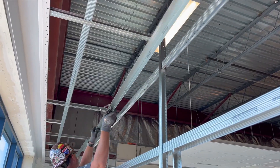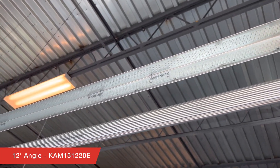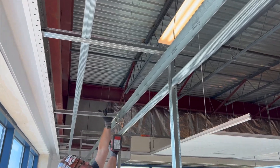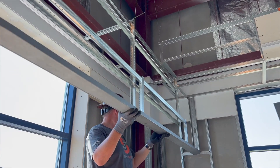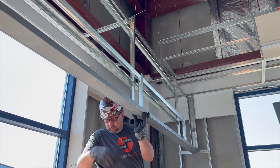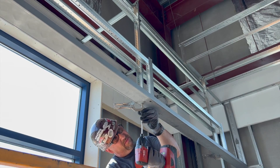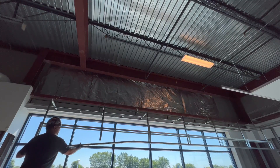At our downward Simple Soffit bend, we are installing our 12 foot CAM inch and a half framing angle. Its 12 foot length ensures it always lands on framing, not between framing. At the bottom of the three and five-eighths inch bend, you can either install two pieces of 12 foot CAM utility angle so it always ends on framing, or standard three and five-eighths inch track.